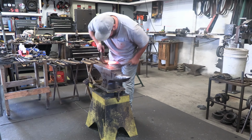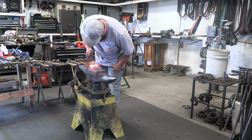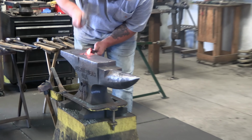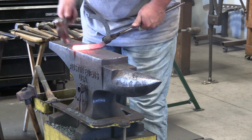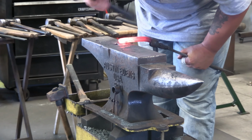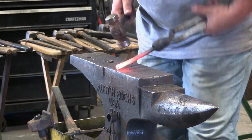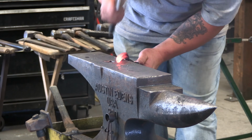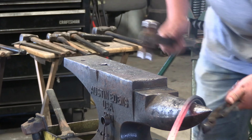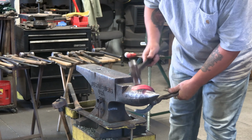All right, this is the inside medial branch of his shoe. And if you notice right here, I'm going to zoom in real quick, he starts safing right there. That's something that is real nice to do on concave shoes. You fold that back edge over, and you have some safing on that medial side. If that horse ever comes in contact with the other limb, you take that edge away from the shoe, and that way you won't have a sharp edge interfering with the other limb.